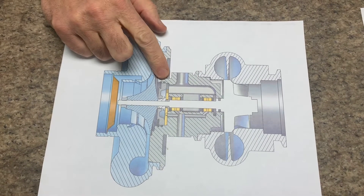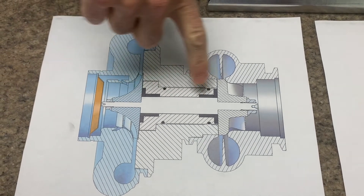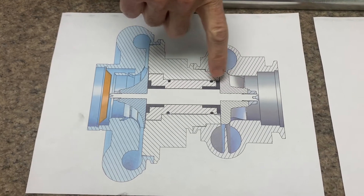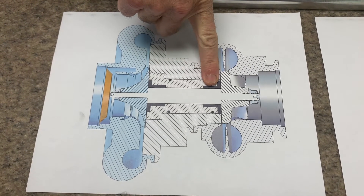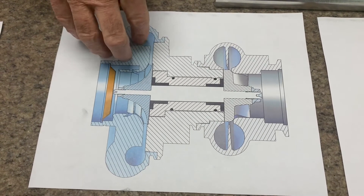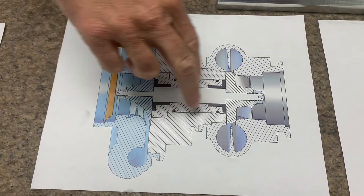What we would suggest as the best design is to run directly on the back of the compressor wheel and on the back of the turbine wheel. We recognize that this is very hot, but because we can make these from ceramic matrix composites that are fired at 800 or 900°C, they can withstand this sort of heat. So now you're just bringing air pressure into this assembly — no oil whatsoever — and running on the backs of the impellers.